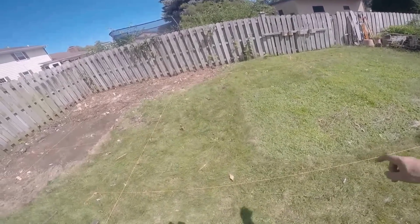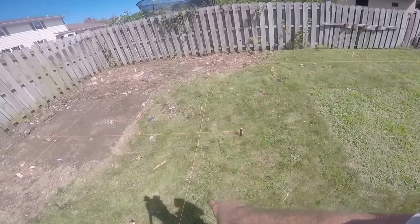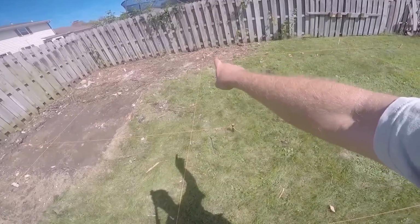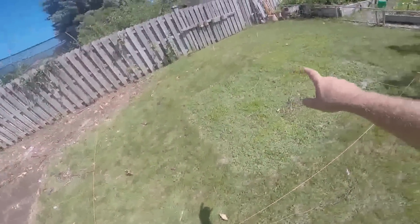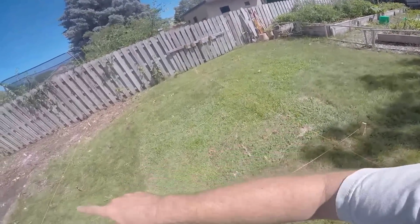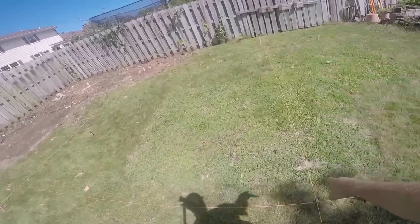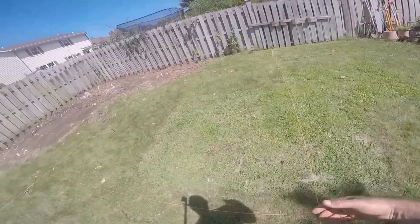And my plan now is to dig first these 3 holes and get those set in concrete, perfectly aligned, and then I'm going to use those. So I make sure that I measure off of that. I don't want to just trust these lines, so I'll measure over and mark them here so I get a nice straight line here as well, and go from there.